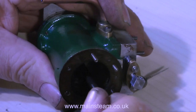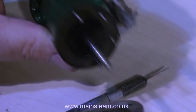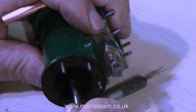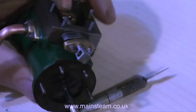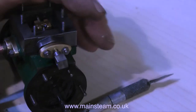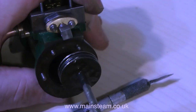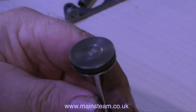Once I removed the cylinder cover, it was very easy to remove the piston, although not quite as easy as the cylinder cover. The piston is actually well machined and quite a tight fit. Normally with the Stuart Models Victoria, or a Twin Victoria, the piston is fitted with a cast iron piston ring. But as can be seen in the current clip, this engine is not fitted with a cast iron piston ring — it's fitted with a strange looking black ring.